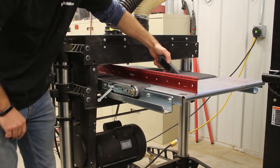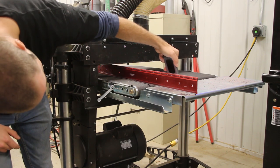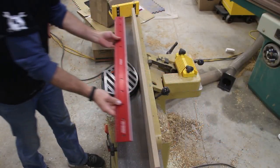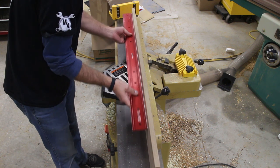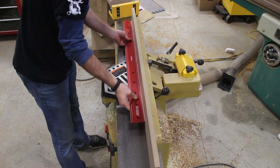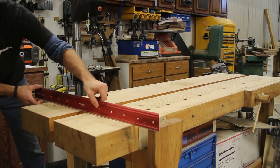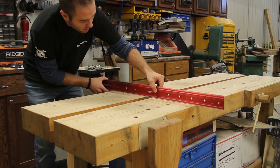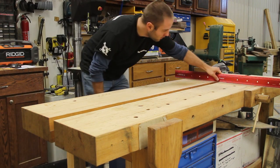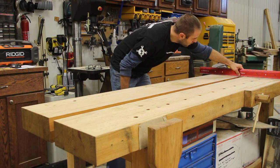So what do you need a precision straight edge rule in your shop for? We use them a lot when setting up new tools or maintaining them — setting up jointer beds, assembling new tools with cast iron support wings on table saws, in-feed and out-feed tables on our sanders, and flattening the soles of our hand planes. Anything where you need to be very precise in tool setup, that's exactly what you need.